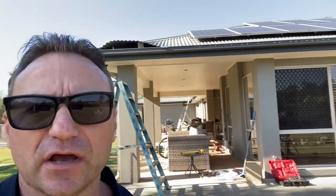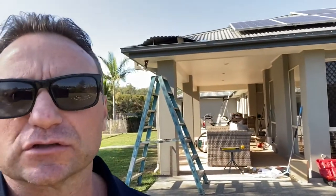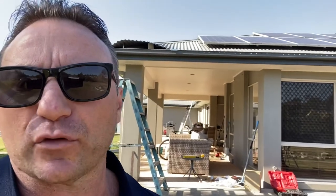With this house you'll see that there are solar panels on the metal roof. With some houses we can pull the solar panels out of the way to put the roof brackets in. Just have a look at your solar panels and see whether they can unscrew or plug out easily — that might be the best way to pull them out of the way, to open the roof sheets up and put the fascia brackets in behind the fascia.